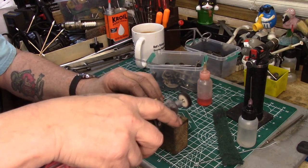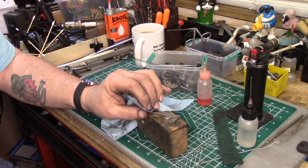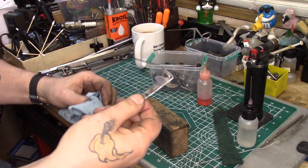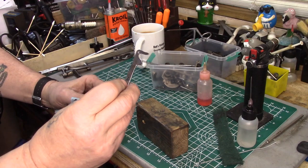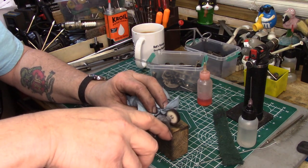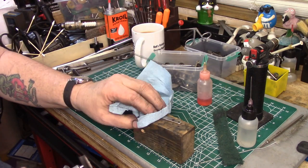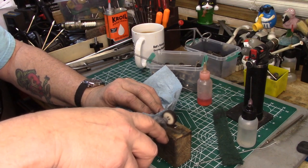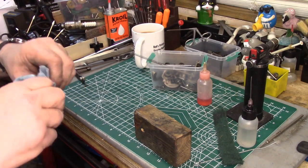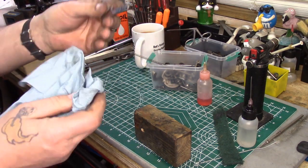On this first pass I'm only going back as far as the first screw so I don't burn my hand — this is already getting really hot. This is another part that ordinarily I'd take to the buffing wheel and buff really quick. One nice thing about using hard felt buffing wheels: they don't shed like the cloth ones do, so it's not snowing in here like it is when I use standard muslin or cotton wheels. After letting it cool and wiping it down, you can see it came up absolutely gorgeous. Remember what that looked like? She buffed up real nice.